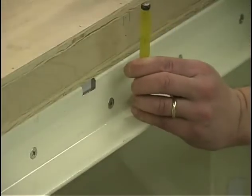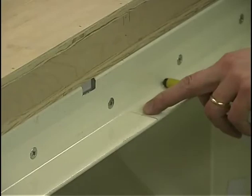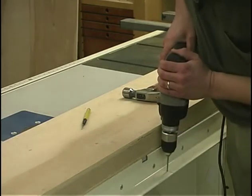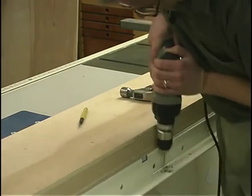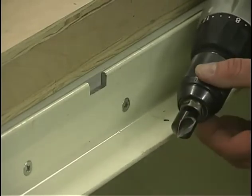Start by taking a center punch and creating a dimple. That'll give the drill a place to start at. I've chucked up my drill bit in my 1/2 inch drill motor. By using the 1/2 inch drill motor, that keeps the RPM on the drill bit low enough where I'm not going to burn up the drill as we drill through this metal. Now if you have one of these single flute countersinks, they can be used to chamfer the holes.